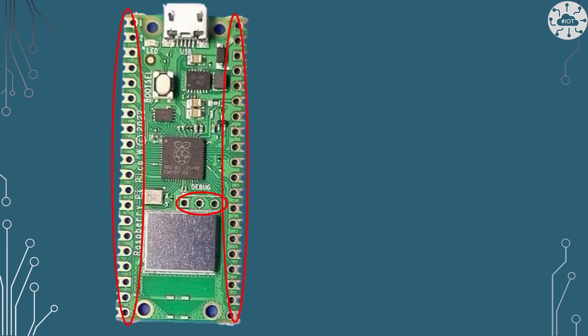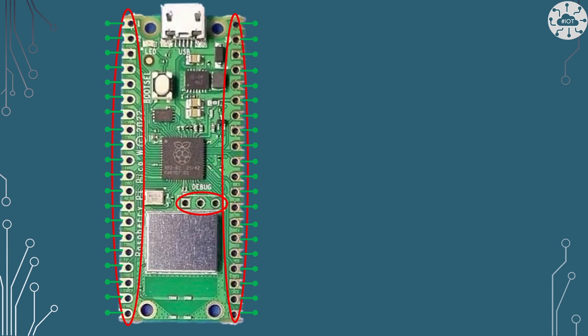I might also want access to other pins on this device as well. So I'm going to design into my PCB holes for every one of the GPIO ports, in case I choose to solder pogo pins into them — though I don't have to. They're just going to be on the board. I'll also have jumper connections out of every one of those ports so I could pull additional signals off for test purposes.